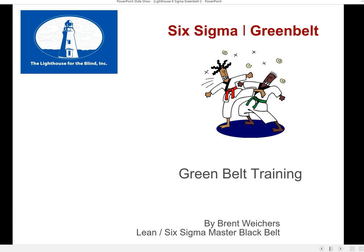The literal translation of Six Sigma is variance reduction. We know we have to be within plus or minus whatever as a specification — that's a range. So often we go to measure something and say I need to be at this target, and we waste all this time trying to hit that target instead of thinking, well, I just need to be within a range. How much energy is spent trying to hit the target when the customer just says hit the range?